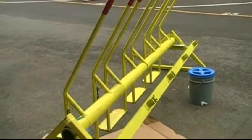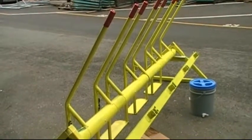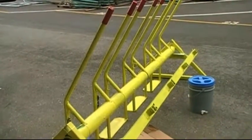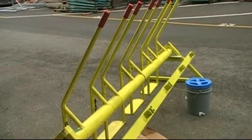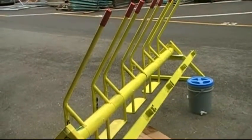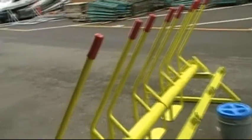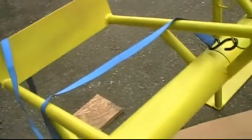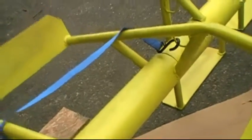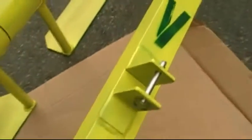Hello, this is Dr. Larry Green again. We're looking at the offloading tool designed to handle four 55-gallon fermenters at a single time. The cradles which hold the 55-gallon fermenters in place can be tipped, and the barrels are strapped to each cradle. They're locked into position with locking pins.